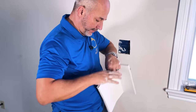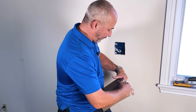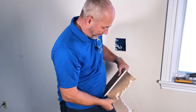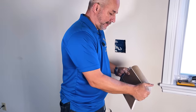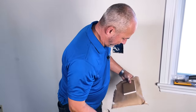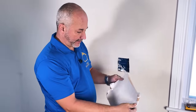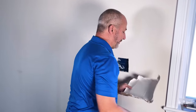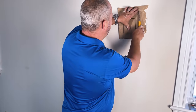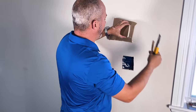From here, using our fingers, we push on the white paper against our thumb and peel the drywall off the paper all the way around. Now we've got a piece of drywall to fill the hole and the paper we're gonna use to patch the wall with. In this particular case the drywall is extremely large so I'm just gonna trim it back to something more manageable, because we don't need a lot of paper. Less is more whenever you're doing work with drywall.